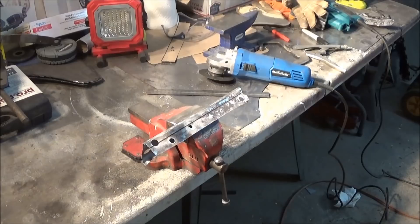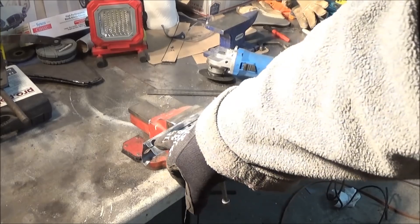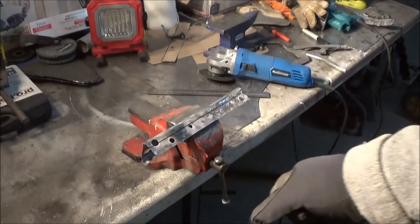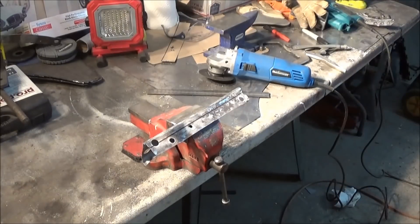I've just marked out the back side of this bracket that we're going to cut. I'm trying to keep this one hole for reference - I believe this is a drain hole for it to drain back down through the inner sill. So we're going to try to keep that as a reference point. The rest of it we're just going to cut out and put a new flange in there. So here we go.